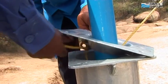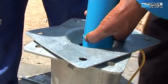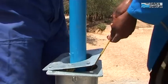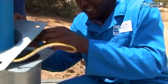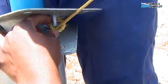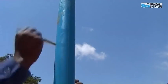When the whole riser assembly stands on top of the foot valve, make a mark in the riser pipe at the top of the cone flange and lift the riser assembly so a new mark can be made 14 inches beneath it. Cut the open end of the rope, attach it to the other eye under the cone flange, and tighten the knot securely. Then cut the riser assembly pipe.